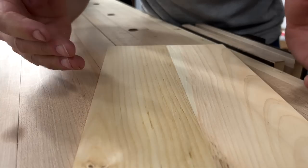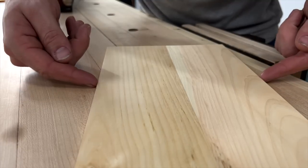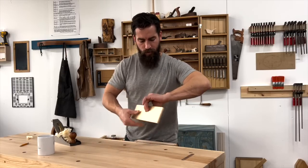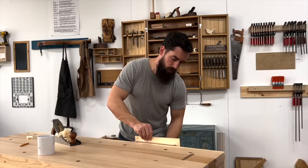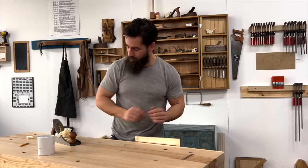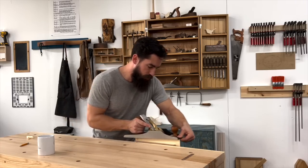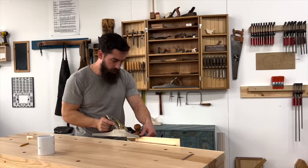But for a rub joint we want to have a perfectly flat meeting surface along the entire length of the piece, because we're not going to put clamping pressure on here. So I want to make sure as I put this in my vise that my joint is flush all along the length of those two pieces. I'm going to lock that down and now plane across this — just a couple of nice strokes, nothing super aggressive. That looks pretty good; I'll take one more stroke for good measure.